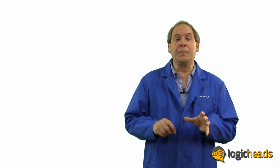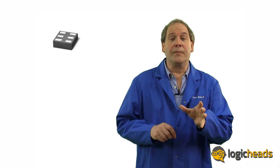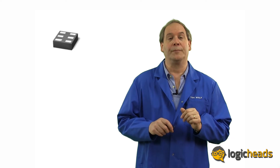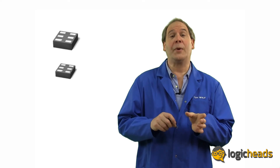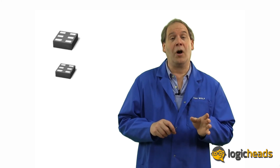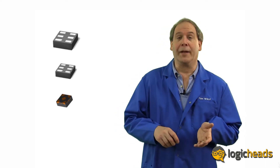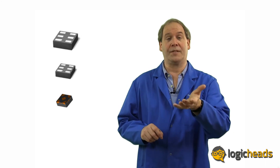For several generations, NXP has been the world leader in the smallest logic packages. First, there was the GS package at 1x1mm with a 0.35mm pitch. Then the GN package at 0.9x1mm with 0.3mm pitch. But not sitting on its laurels, NXP then set out to beat itself with an even smaller package called the Diamond package. This is the Diamond package — it's a 5-lead package, which is great for most single logic devices: power, ground, two inputs, and one output. That's five pins.